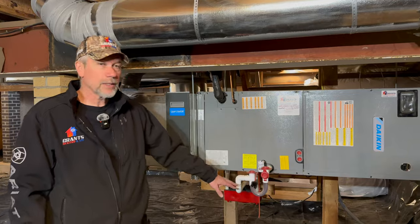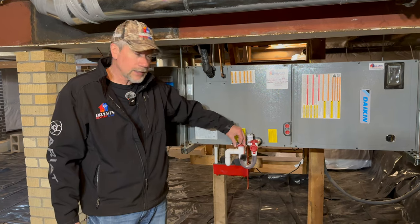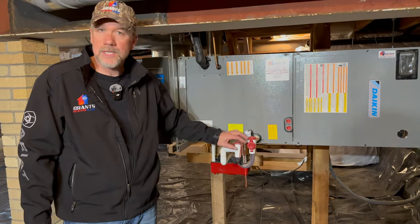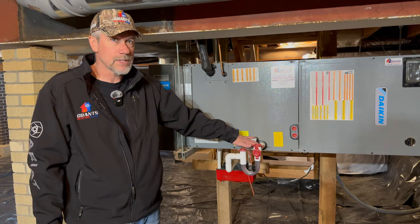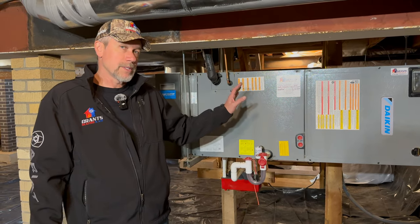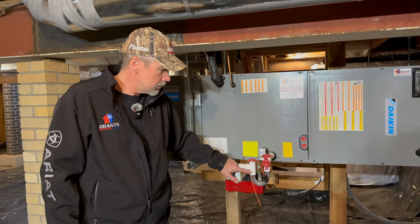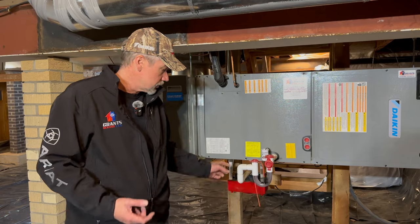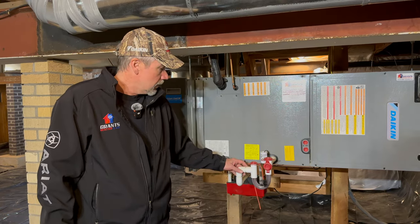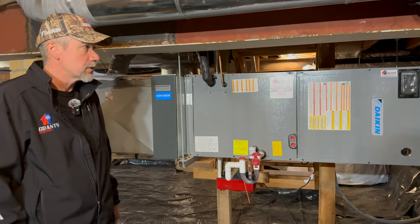In this application we added all the ductwork and went all-electric in a horizontal position. I want to show you this clear P-trap — we like to use these because they have pop-top caps for easy cleaning. We leave the customer a brush for maintenance in case it backs up with water. This only applies in cooling mode — in heating mode all the water is outside at the heat pump. In air conditioning mode the coil does condensate, so this clear cleanout lets you see if it's getting plugged with algae or debris.